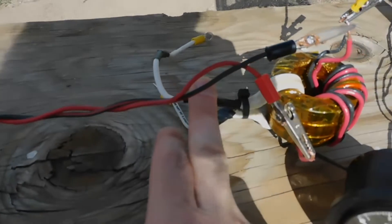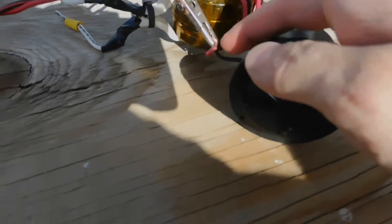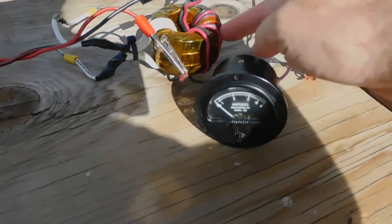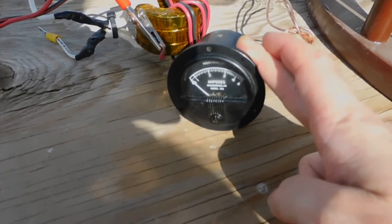There's an extra set of windings here that isn't being used. Essentially the red winding is being used to drive from the ham radio side, and one end of the black winding is running through this RF thermocouple amp meter.